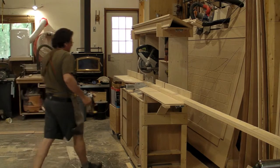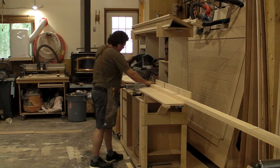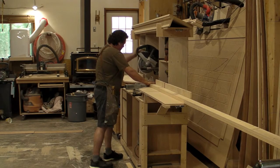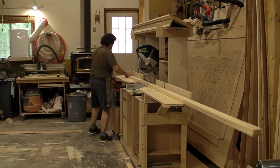I'm making an overhang flat. It's for when you have an outside corner, two walls meeting, where the frame of the luan is narrower than the luan, and the luan overhangs and it caps the end of another flat.